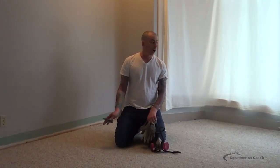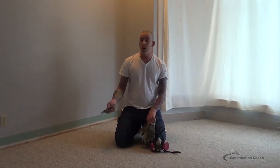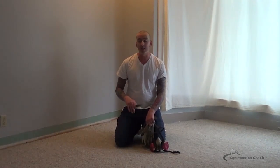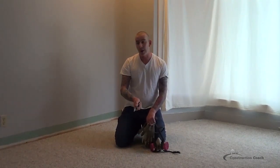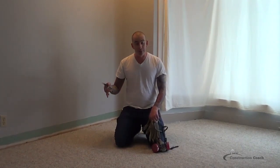So now I'm going to show you how to do some carpet removal. They are going to pull out this carpet and put down a new floor, so I want to take it out in the cleanest way possible. I've found over the years that I like to use a utility knife, cut through the carpet in about five or six foot widths, and then roll the carpet up. Once I've got it rolled up, I'm going to wrap some tape around it to keep it rolled shut so that it's easy to carry out of the room, then move along to the next strip.